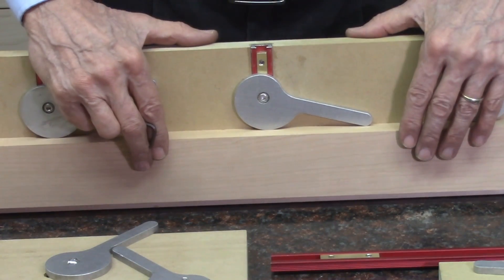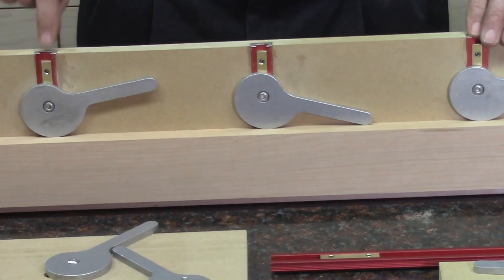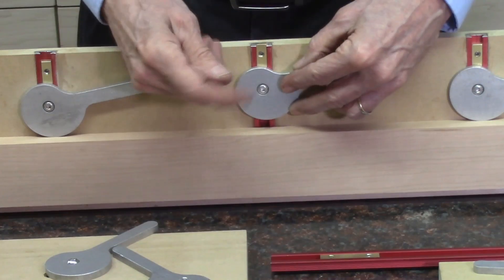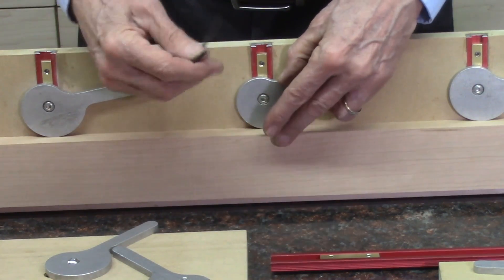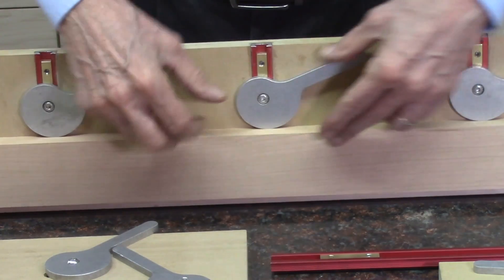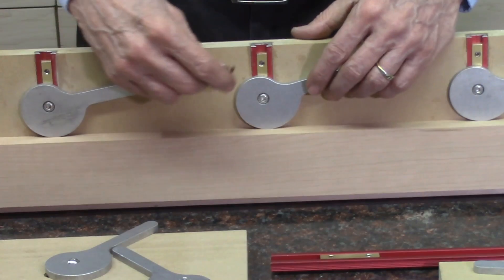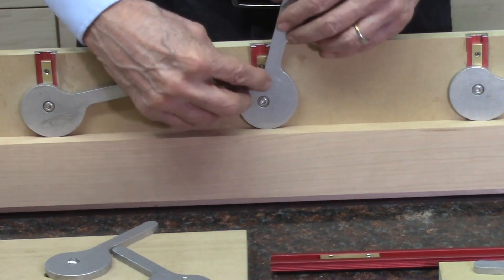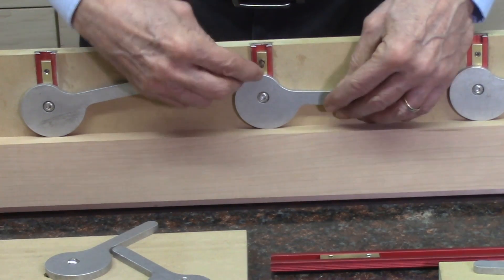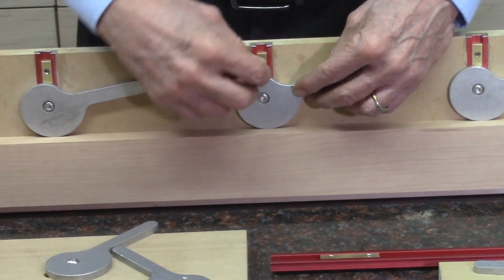I have a number of T-slots dotted into this piece of MDF. I just adjust my clamp to the correct height when I get my board set, lock it in place with an Allen wrench, and then tighten my clamp down. It's a very nice, quick, easy way to adjust the clamp — I can put it at any position I want, up in the air or down. So I've got a complete range of motion for clamping boards of various thicknesses.